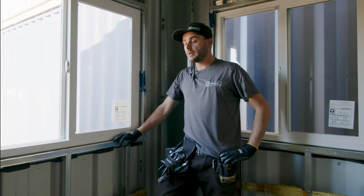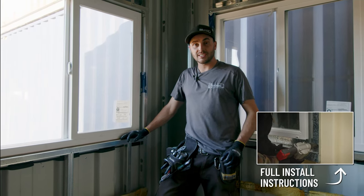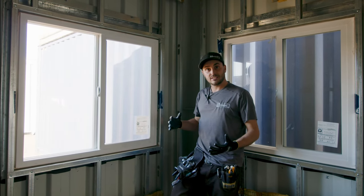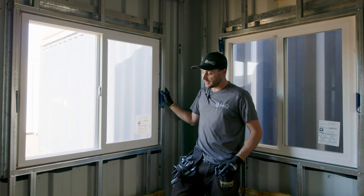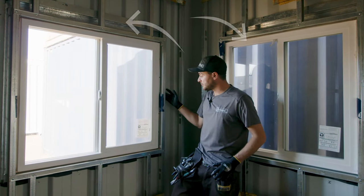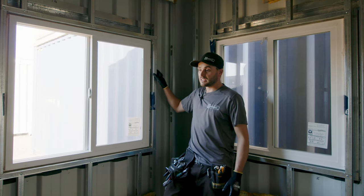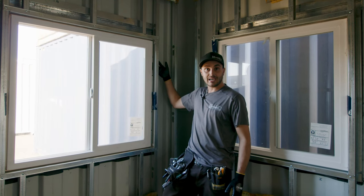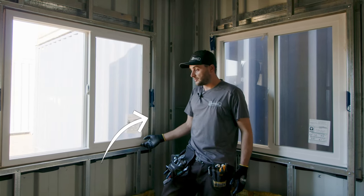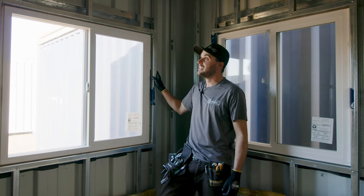I'm not going to go into too much detail on the installation of the window kits or the man door because we have full comprehensive installation videos on our channel. I'll give you the interior view of the fenestrations and how we've steel studded around them. These window kits are all laser-cut and folded sheet metal with no hollow section, so spray foam can come all the way around and touch the vinyl window for a perfect vapor barrier. With the steel stud brackets and inch and five-eighths studs there's the same gap behind them, so the closed cell spray foam will come right around and touch the studs — no need to come back in with a can of spray foam.